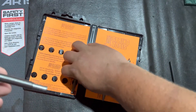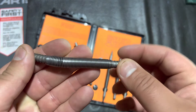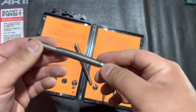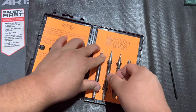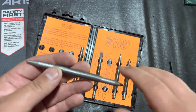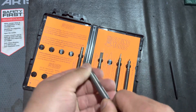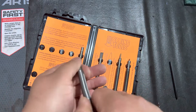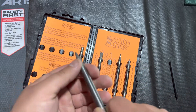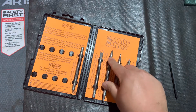You can see where the split is on this one — it's in the middle. On this one, the split is closer to the chisel side, which gives you a heavier anvil side, so when you're striking it gives you more force. This one has a starter punch and a finish punch. You can see where it bends — you'd strike it with the lighter, smaller anvil side first, which has a sharper tip for a precision starting point. Then go back with the bigger anvil and wider tip to get a deeper hole so your drill bit won't slip.